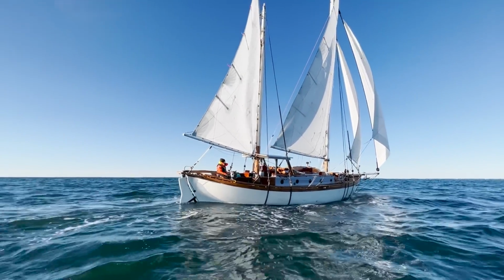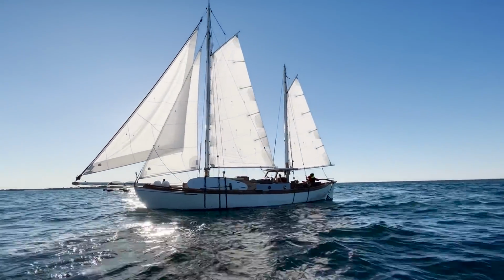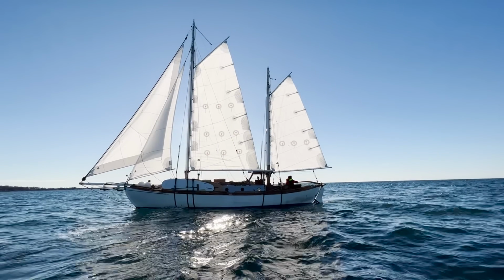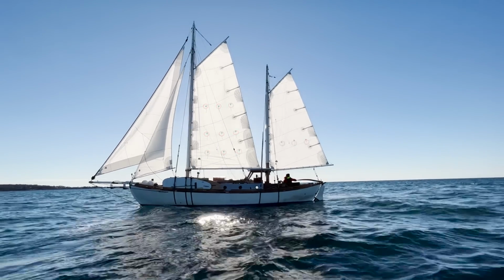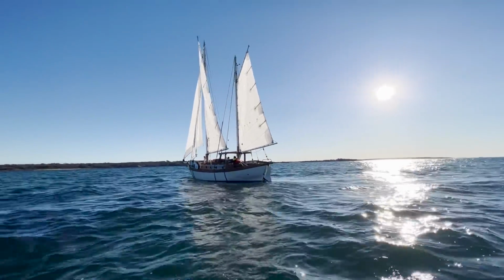The challenge for Steve with this design is that it will change the way he needs to reef the sail. With no stack pack, the reefing lines, seen here, can wrap around the bottom of the boom. That won't be an option with the cover in place. Ed was there to help Steve sort out what he'll need to change to make it all work.